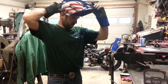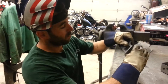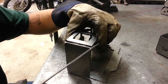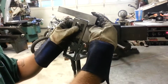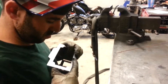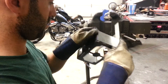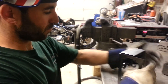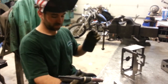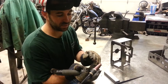Helmet. Now when we start to weld this, it doesn't matter which side — top or bottom — you begin welding. But either side, you're going to want to manipulate the pedal so you're not generating too much heat, because it's very easy to completely burn out these ends. I use a filler metal ER70S2, 1/16th inch in diameter. I use 2% thoriated tungsten and a number 6 cup.